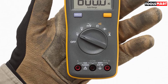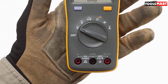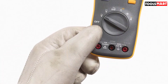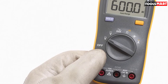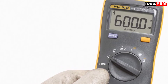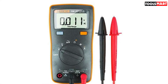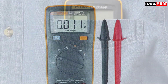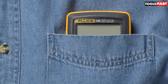Compared to the Fluke 101, the Fluke 106 adds an additional parameter of current measurement that was absent in the 101. It is capable of measuring up to 10 amps, both AC and DC. This auto-range multimeter is built according to IEC safety standards and is suitable for CAT 3 systems. Although manufactured in China, we don't find it lower in quality or accuracy compared to US-based multimeters. Its palm size makes it easy to fit in your hand or work uniform pocket.